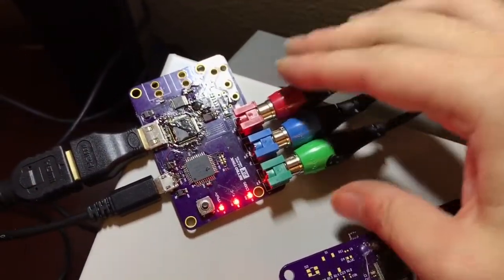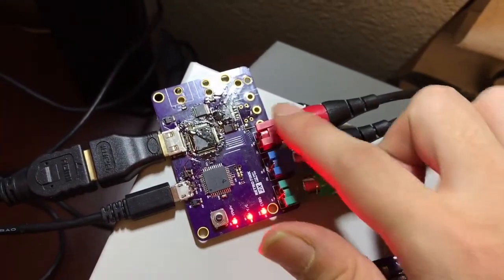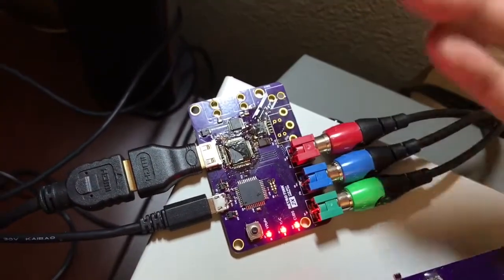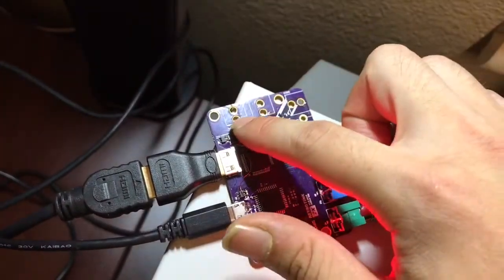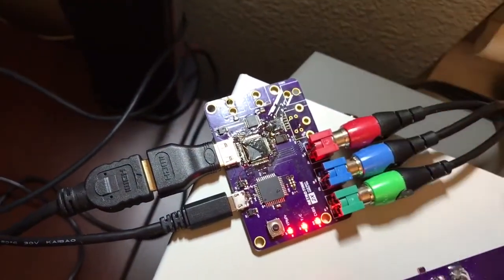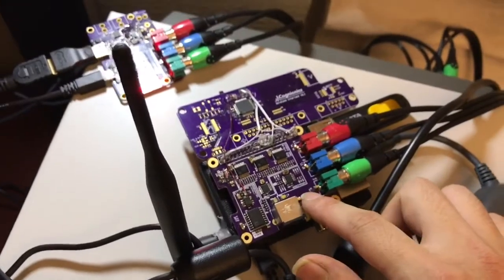Okay, right now, I want to go through the setup before showing some images. So right now I've got component inputs going to the line doubler. This device also will eventually support S-video and composite. Haven't soldered those in, haven't programmed the firmware to recognize the sources. It also supports audio capture with standard RCA jacks and an A to D, but again, haven't enabled that yet, early prototype. So feeding the component inputs is going to be my Raspberry Pi through my RetroTINK.